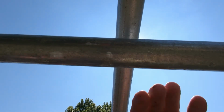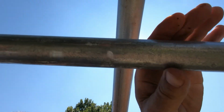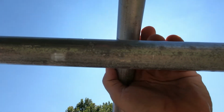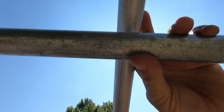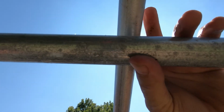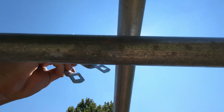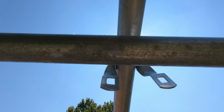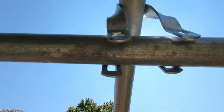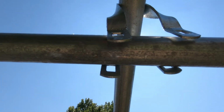Okay, so I'm back up here in my middle bow now. I've got my middle mark from when I bent the bows right there. You can't see it from here, but I've got my blue mark right here. So I want to get my blue mark right on that bow. I want to take these things and slide them over the bow, with the bolts needing to be pointing towards each other like that. Okay, then we'll get my bolts ready.